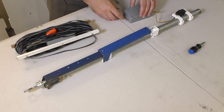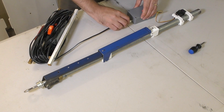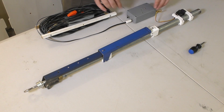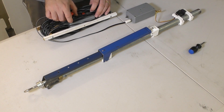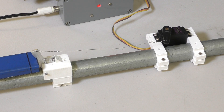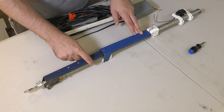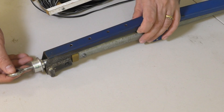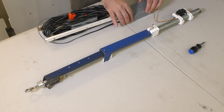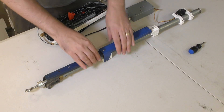We've got a little control box — this is actually going to be part of the main controller but this is just for testing. We hook in our remote trigger, turn it on, then we can arm it and we're ready to release — we just press the button. That drops the secondary lever, releasing the primary, which is opened by the pressure of the nozzle pulling out. To reset it, turning it on returns the tertiary lever and we can lock it in place — now it's ready to go again.